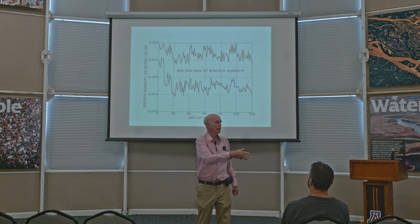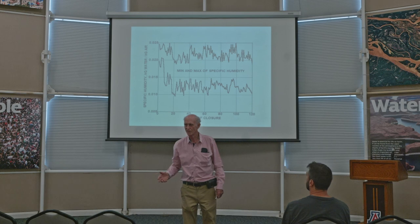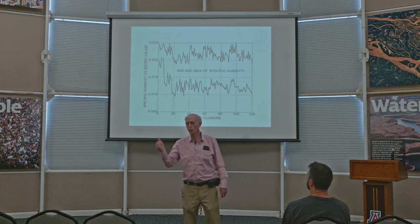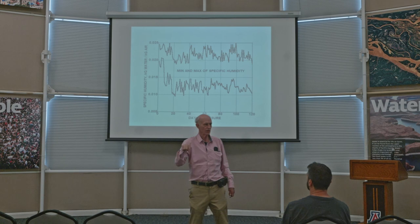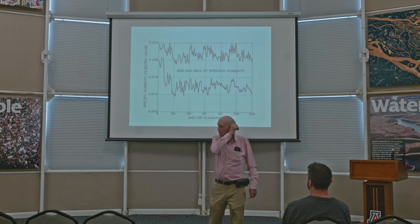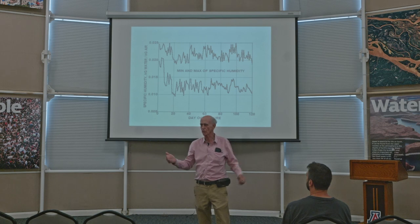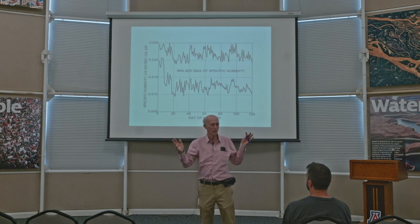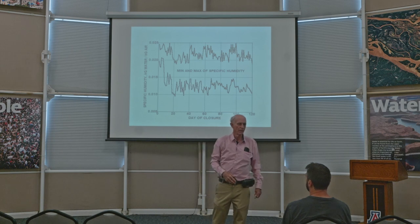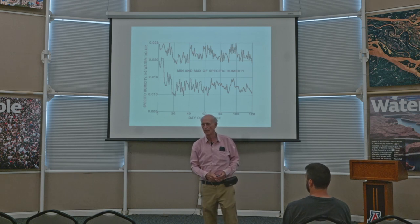Now, why doesn't that happen right now? Why isn't this building exploding and or getting crushed? Well, because it leaks. It leaks all over the place. Not the original version of Biosphere 2, but this version does, because it's been altered since the original version, which was built in late 1980s to early 1990s. And it leaks a lot. So when the air expands, it just goes out the cracks around the door, the window, or thousands of cracks that are everywhere. And when the contraction happens, the reverse happens, outside air flows in. So that, in any ordinary building, is continually relieving the development of pressure. And it's not an issue.